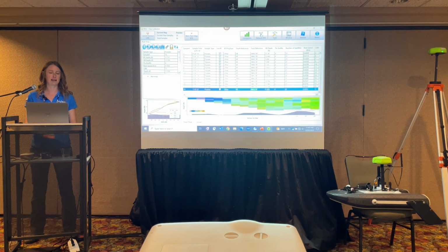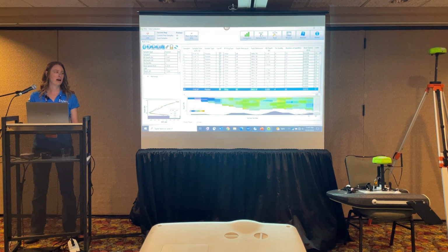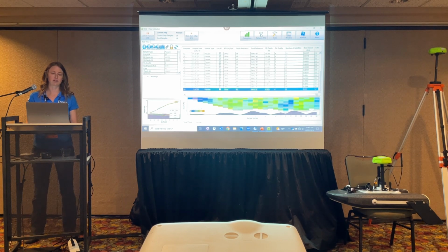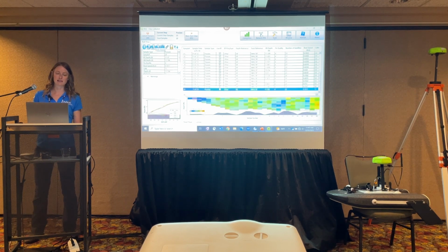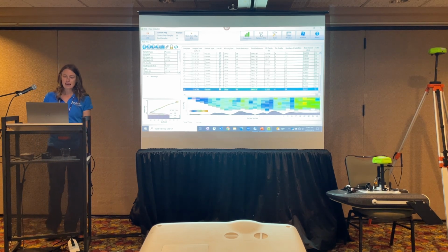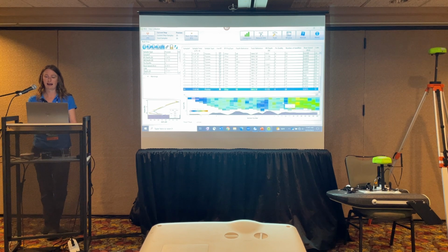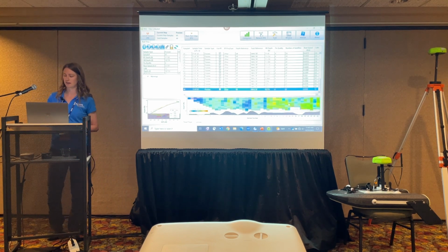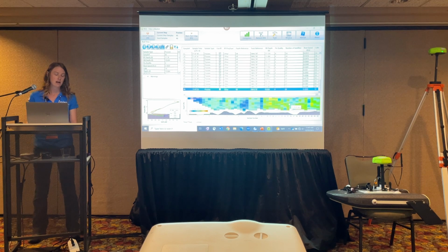So we're checking to make sure that our GPS icons up here are live. If I was waiting for RTK, then I would be waiting for this RTK symbol here to go blue. These will be yellow and red before you get locks. And then I'm also making sure that where I have my boat positioned at my edge, I've got enough cells underneath. These color rectangles that are populating here are all the cells that it's measuring underneath it.